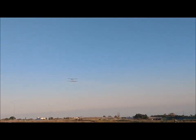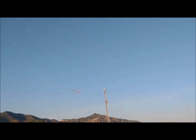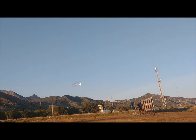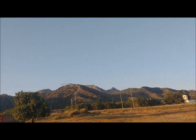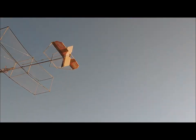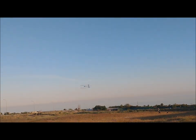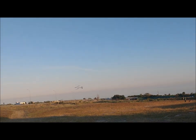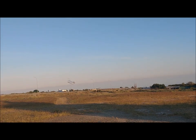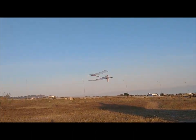We have also noted that the plastic of the wings inflates and deflates at times, which causes the lift force to be highly variable. Despite having decreased the horizontal stabilizer decalage, the aircraft still shows a heavy tail behavior. The cause seems to be the motor, which has a slight upward tilt angle. This causes the plane to pitch up when we throttle up. For this reason, the position of the center of gravity must be set forward.